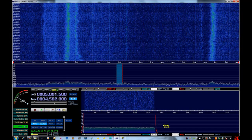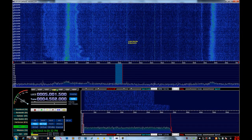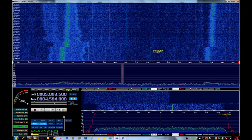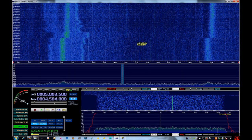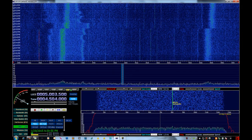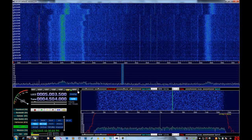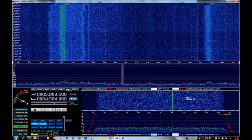The audio waterfall is very important when defining a mystery signal. I always use CW mode to signal-spot, and I've always used it where I could, because CW is the most effective mode for determining whether a signal is a dead carrier or has information on it. It doesn't matter whether it's AM, FM, digital modes, or sideband — CW will tell you very quickly what you're dealing with.